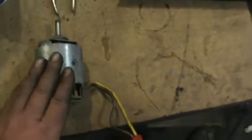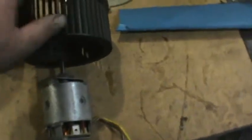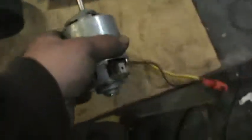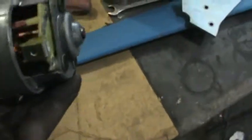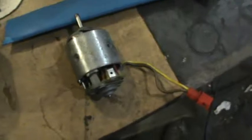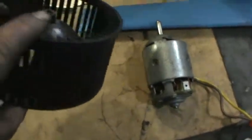So today here's what I'm up to. I bought one of these universal car blowers from Princess Auto — it's just surplus junk they have laying around, you can pick it up for five bucks. It came in this housing here and it's just a DC motor hooked up to a squirrel cage blower. There's not one screw in the whole thing. I figured all that out and managed to get this blower cage off. The reason being, this is a DC motor and it's not an efficient one — it's brushes. I'd have to put a battery charger out there and a battery and keep it running nonstop, so I wouldn't be saving a lot by just putting electric heat back in the greenhouse.